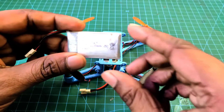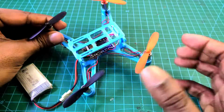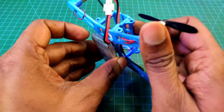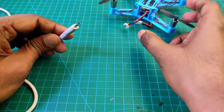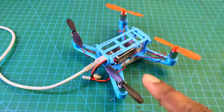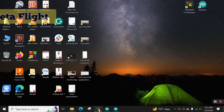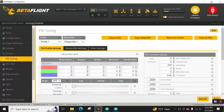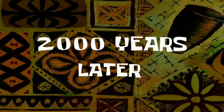Our drone is now ready. For this drone I am using a 1200 mAh 3.7V battery. I check all of the connections and connect the battery to the drone. Now we need to program our flight controller, so I connect the USB connector to the drone and then to the computer. I already installed Betaflight software and use it to set up the flight controller.